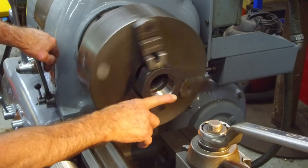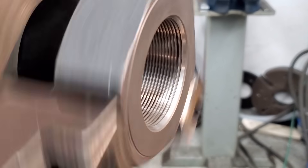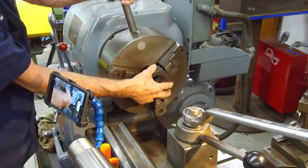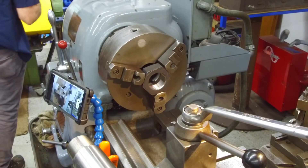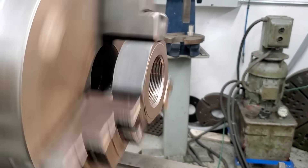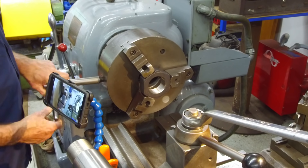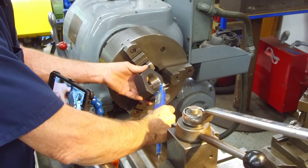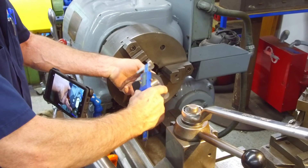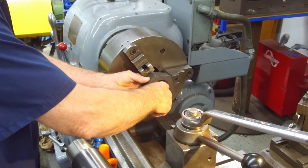You can see how the thread pitch is actually wobbling in there. Let me get you at this angle — you can probably see it a little better. We've tried other locations, tried rocking and setting this. It's still got a nut that doesn't quite run true with the pitch of the threads. We've taken our calipers and checked our wall thickness from the ID of the threads to the outside of the flat of the hex, all the way around on both nuts — they're within five thousandths. So here's how I'm going to show you to set this up, and we're going to trick those threads to run true in this three-jaw.